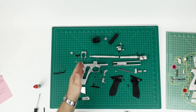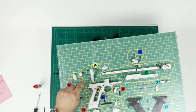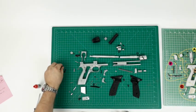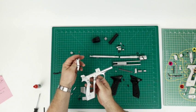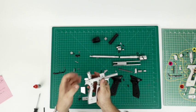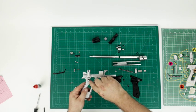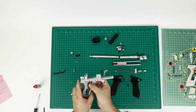Next, we need to jump over to assembly A and put the sight bridge on. There are two dowels: an M2x16 and an M2x20. The longer one goes on the top and has a dual purpose — it also holds the spring for the sear. Slide this on correctly — there's a short side and a long side. Don't spread it; just kind of wedge it on. Don't stretch it or you'll break it. Just slide it down. See how it just locked in right there? Hole, hole, center hole. Same thing on the back.